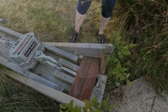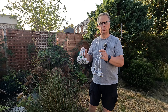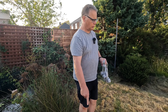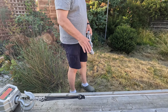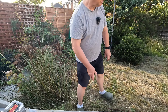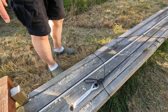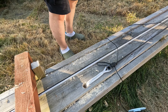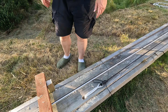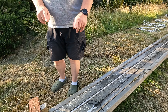The GoPro battery ran out so not sure where we got to, but we've got four more chain plate loops tied here that haven't been stretched at all. This is shroud number eight for the mizzen mast. As well as these four to put in and tighten, we'll do the same with that one and the one at the very far end - those have been stretched somewhat as anchors but only to about 600 pull, not the 1400 we need. We'll take those out, do two more, and hopefully get it all done before dark.